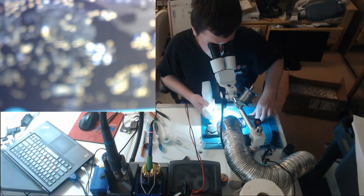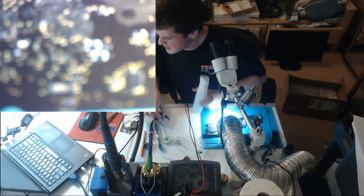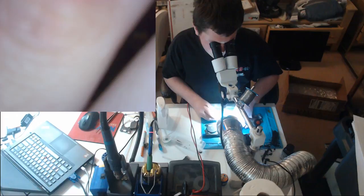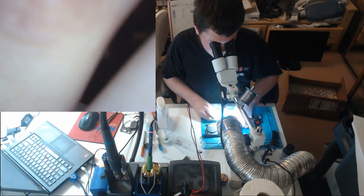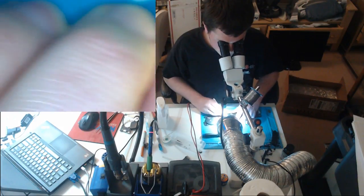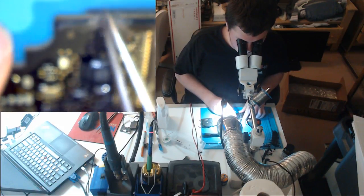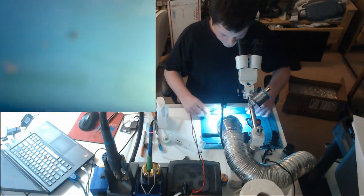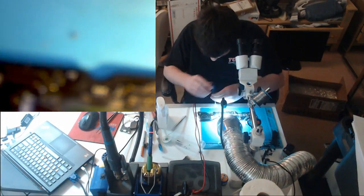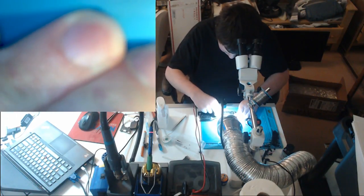Guys are wondering why I'm putting alcohol on the board. It's because there's dust on it, and I can't necessarily tell what's corroded or dust, so I spray alcohol and then I can tell what's corroded. And so far nothing here looks bad. But we're getting no PPBus G3 hot, so let's take off this SSD. I mean, the charger is not supplying power, so.